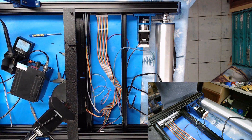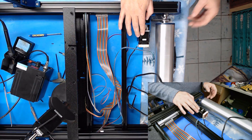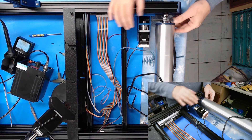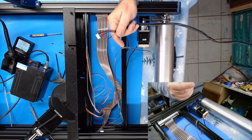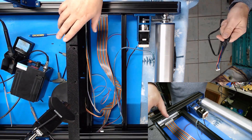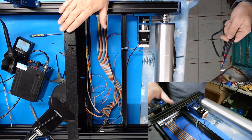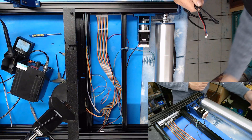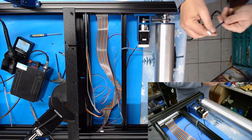For this segment we're going to go ahead and wire up the connector for our Z-axis stepper for the rollers. You're going to need your original cable and you'll need the cover to help you line up where this wiring is going to go. Other than that, just the standard solder, heat shrink, that kind of stuff.